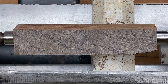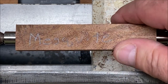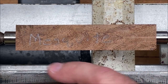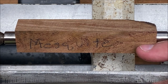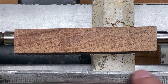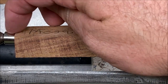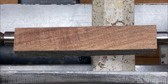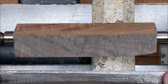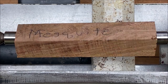I've never turned mesquite before, but looking at the wood and just the feel of it and the way it sands, it doesn't seem like it's all that hard, so I think it's going to turn really nicely. You may remember that when I drilled this blank I got a little bit off — you can see at one end the bushing is very close compared to the other end, so we went at a bit of an angle with the bit. Shouldn't hurt anything; there's plenty of meat above the bushing so I'll be able to true that up. It's just going to look a little weird when I first start spinning because it looks like it's wobbling, but it actually is centered and ready to turn.